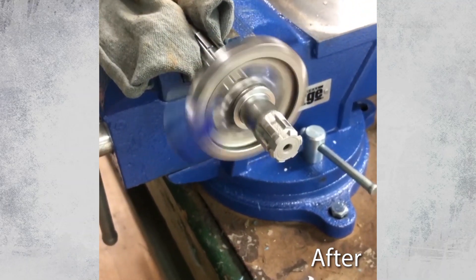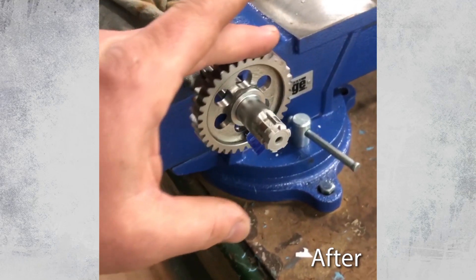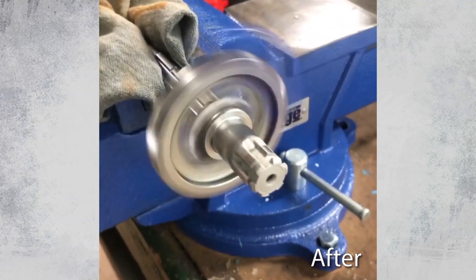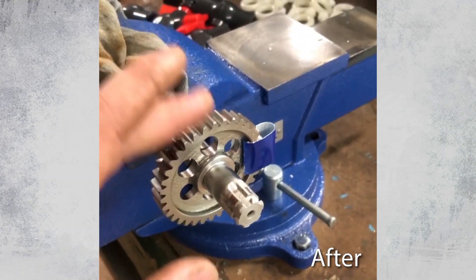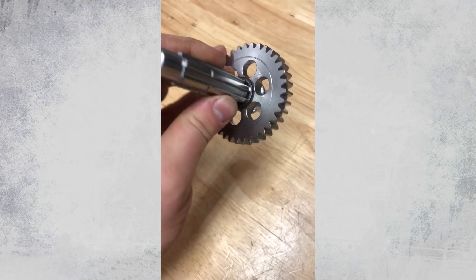There's a big difference just from free rolling. Just remember, this part is dry — there's no lubrication on it. We've only surface treated it with a very specific proprietary abrasive. We've micro shot peened the surface, so we've made it harder and more durable.